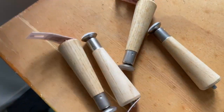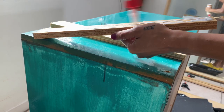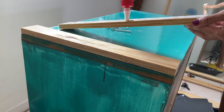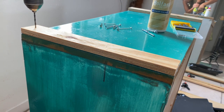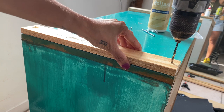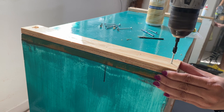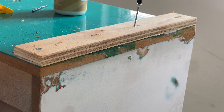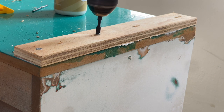I need to use these pre-made table legs to attach at the base of the dresser. Because this dresser is made mainly of particleboard which can disintegrate over time, I'm securing some plywood to the solid wood frame for a more sturdy base to screw the legs into. I got them in place with some Hole Fast wood glue first, then went in with my drill and some wood screws. I'm doing pilot holes for all the screws to maintain the integrity of the particleboard. I repeated those steps on the other side, adding two extra screws for security.